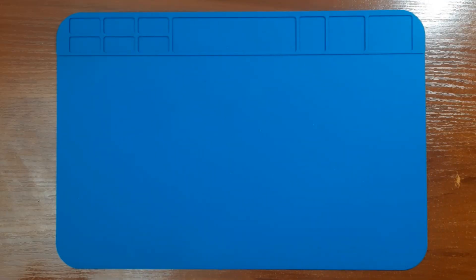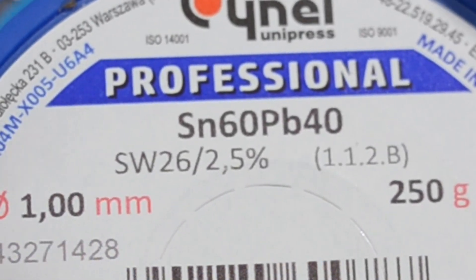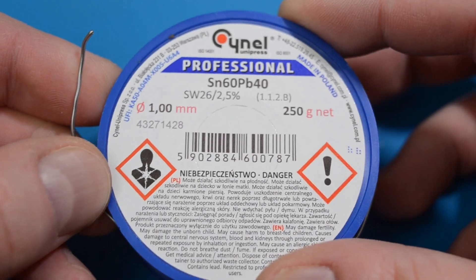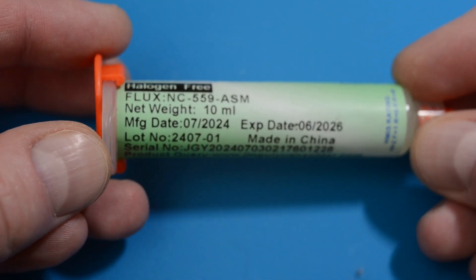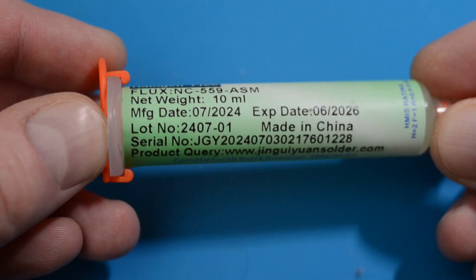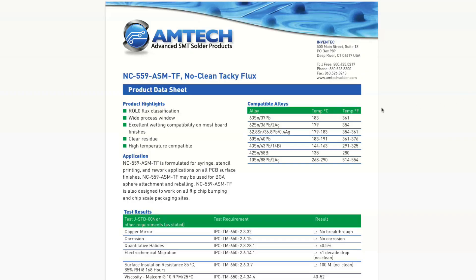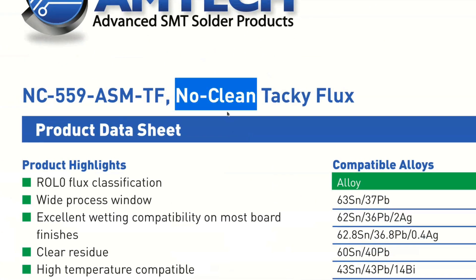For working through the mistakes, we'll definitely need the following things. Quality solder — must be leaded, grade 60/40 or 63/37, and preferably with flux core. Good solder is a very important component of quality soldering — probably the most important. Flux is also an important consumable. It magically helps the solder to stick where it needs to go and not stick where it shouldn't. So you'll also need flux gel, for example in a syringe tube. I recommend getting one labeled as no-clean, but wash it off afterwards anyway — it's more reliable that way.